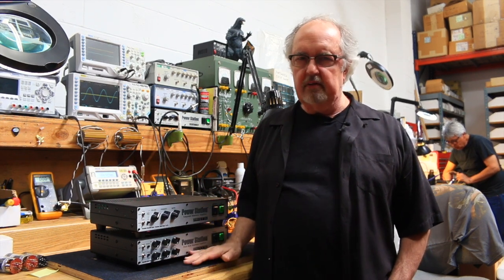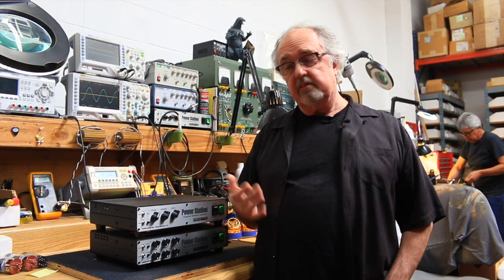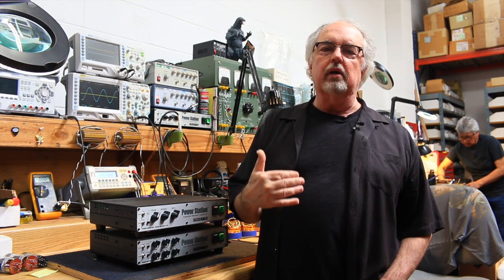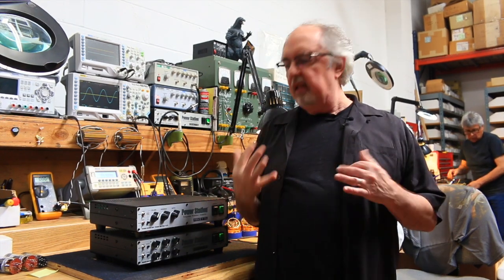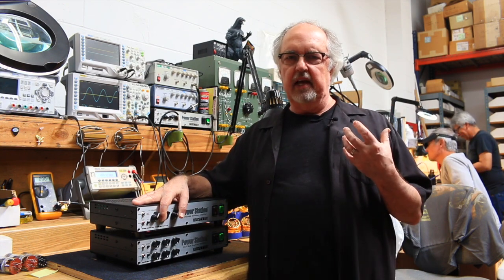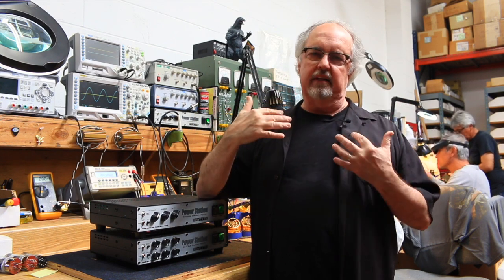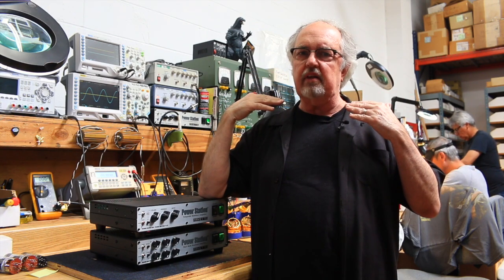The PS100 has got 6550s, which are basically double powered 6L6s. So in the same respect, they're there to just transfer power from here to your speaker cab, not accentuate it, unless you want to, like using the presence and depth controls, for example. But even then, those controls are there to restore what you had already coming out of your amp at a reduced volume.